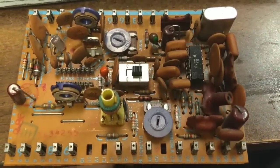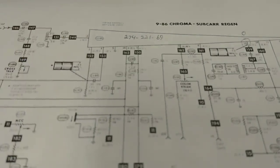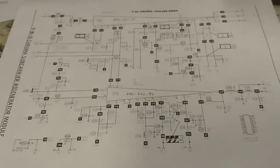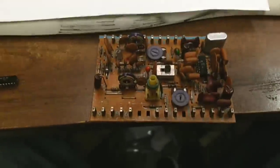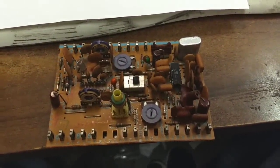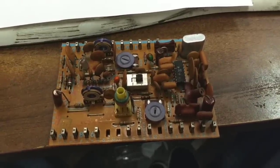I've got good feedback from the flyback. I've got color information, burst information on this reference pin here. Pin 3 it was. That's working. So, really, my only thing now is to replace that IC and see if that brings this little board back to life. Because I have no color activity whatsoever. And no voltage on pin 13. There's supposed to be about 5 volts and there's no oscillation either. So, that's where we're at with this thing.